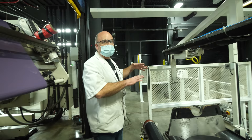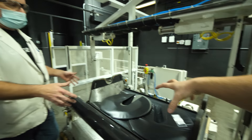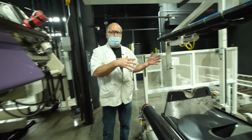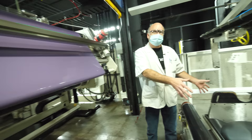This is all dark. The film comes in to the cover lifter, which takes the cover off the casket. Once that's off, we go in, check the roll, make sure we got the right roll, hit some buttons, and it automatically loads onto the slitter. This slitter processes 12,000 feet — so one of these large caskets holds 12,000 feet. We usually do the full 12,000-foot roll, and there's about five feet per 35mm roll.